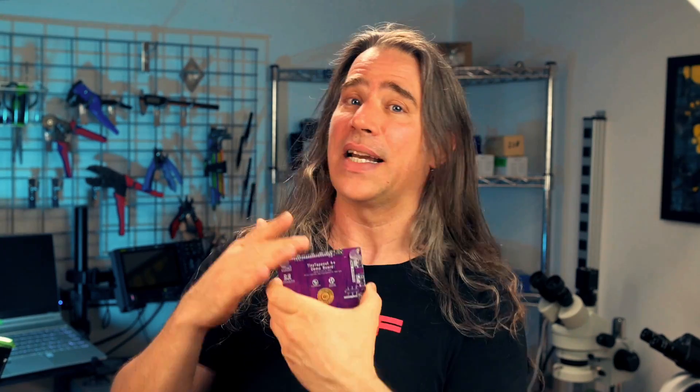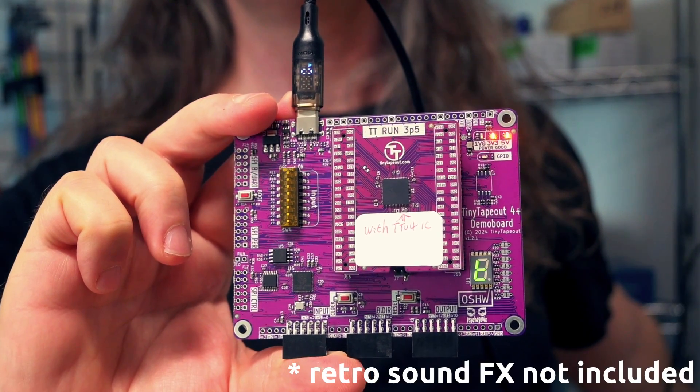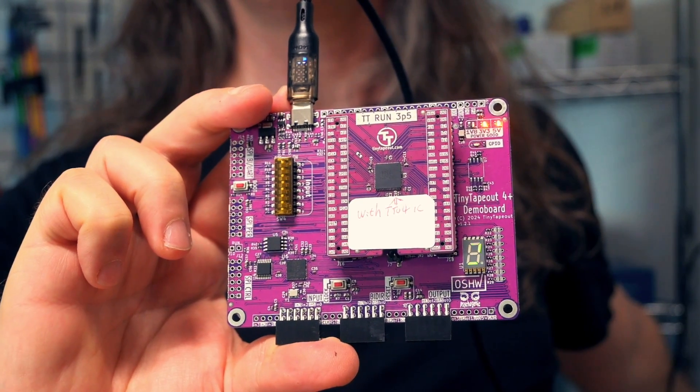The whole system has been through QA and should have a nice sticker, but it's also traveled a lot, so first thing is to take a quick look and make sure the carrier is well installed and nothing's broken. Next, get a cable with a USB Type-C connector and a power supply or phone charger — anything that's 5V. Gently stick it in there and power up. The draw is less than 200 milliamps so nothing should get too warm or smoky.